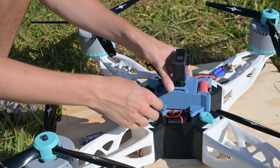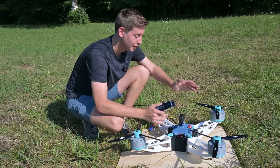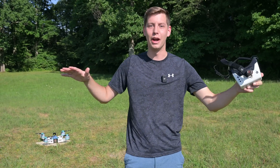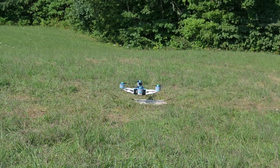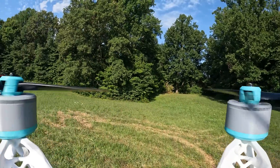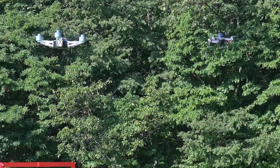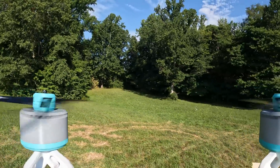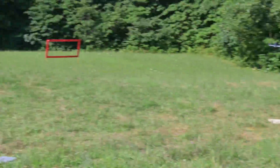After about a month of traveling, we can actually get back to what I started doing with this — trying to fly it like an FPV quad. I took it out to a field nearby. Today we're going to use these giant six cell batteries. It's still probably not going to fly for very long because this thing is so heavy, but it should at least fly. I have FPV goggles, but I don't trust myself enough to fly this without knowing where it is, so I'm just going to have the feed pull up on a laptop. I flew a short test flight just to see how easy it was to control using the FPV feed. Unfortunately, this thing is actually pretty scary to fly using only the FPV video — you end up with a great sense of the quad's orientation, but not necessarily its location relative to you. And with a quad this big, that can be really dangerous. One of the motors is potentially going bad, so let's put it down.